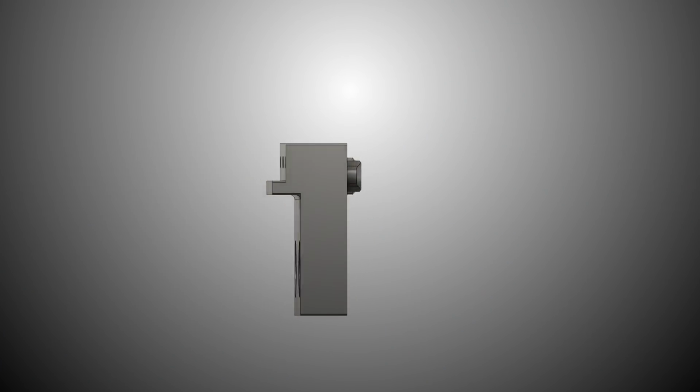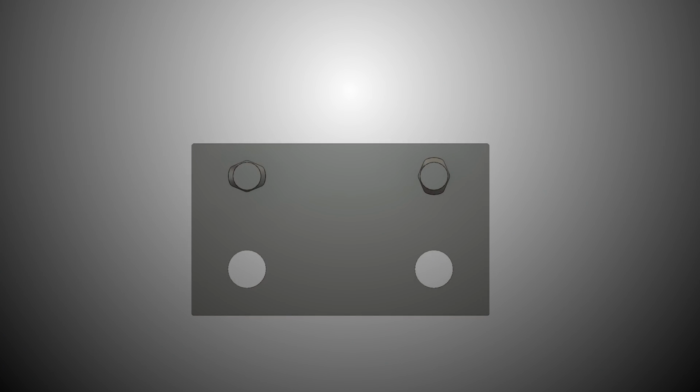Now the distance between the center of these diamond pins and the plane across the front side of the mod vise isn't critical at all whatsoever. It could be 3 inches and it wouldn't make a difference, but what is critical is that the distance between the 2 centers and the front plane is the same on each pin. If not, the vise isn't going to sit square in your machine, and therefore your parts aren't going to get cut square.